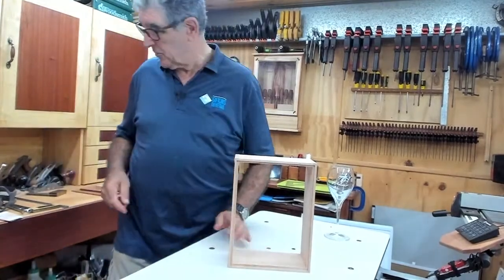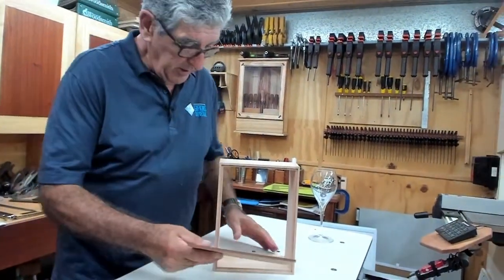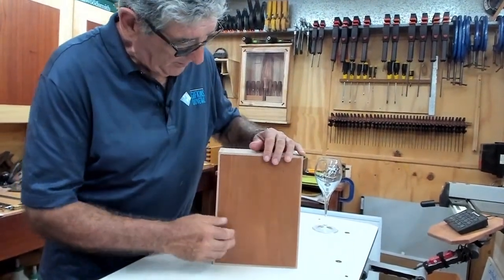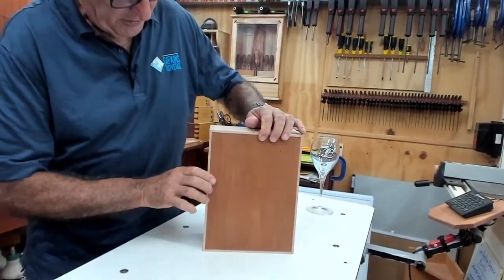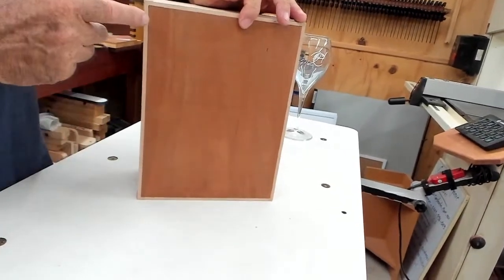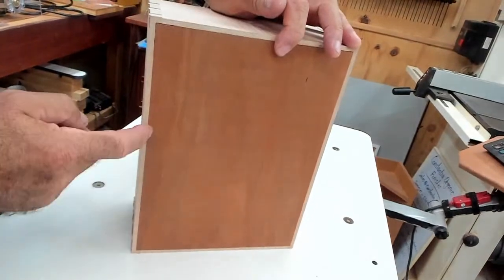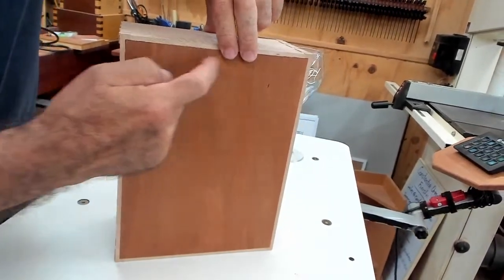So what we had to do is we had to build, and I did it while you were sleeping, I built the back panel out of rose mahogany so that it fits in there quite nicely. Now, it's not hard to do that. I've just made sure that it's 4 millimeters, which is the depth of the rebate. So that will give me actually quite a nice rebate.